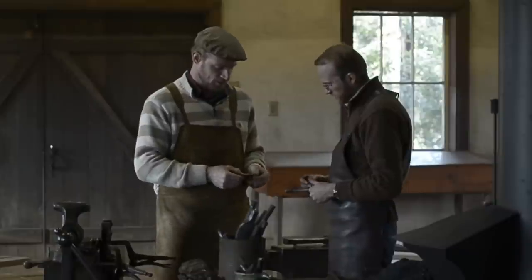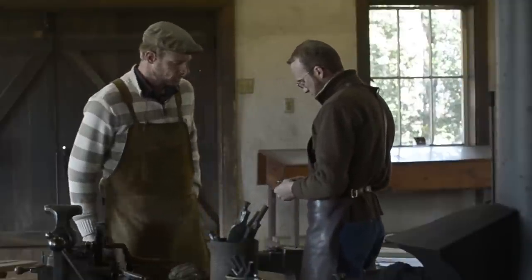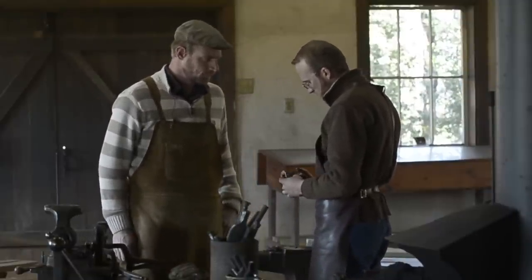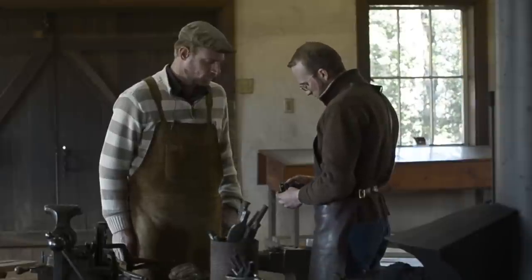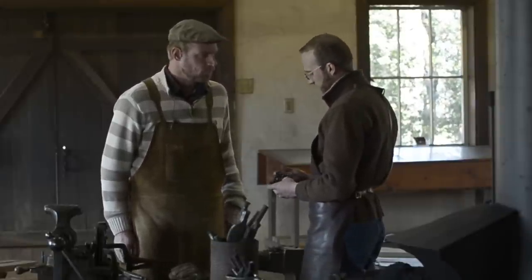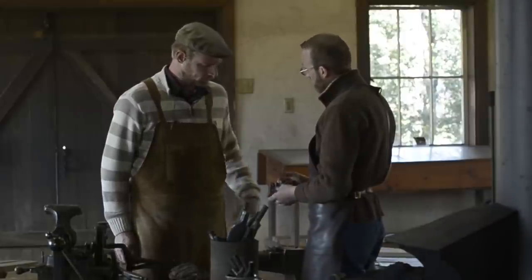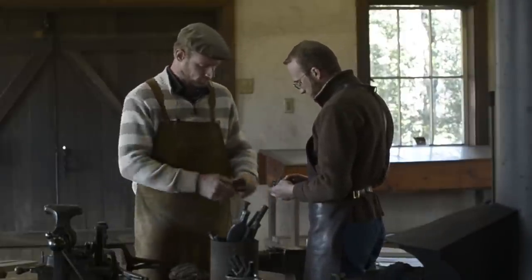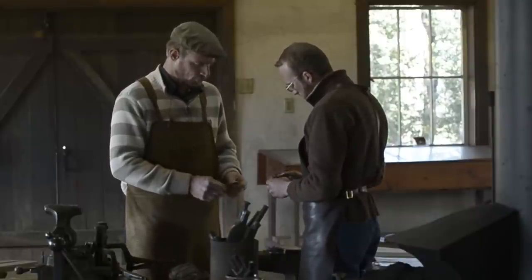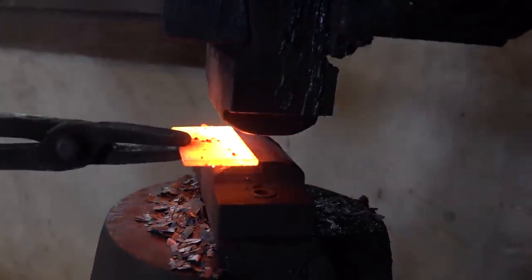So, how did you do these hinges? These are great. Start with a flat piece. Our relief needs to be three-quarters, so start at about an inch and a half. The part that needed to be the barrel, we need to draw down a little bit, thin it down, because bending a full eighth around that tight would be very difficult. So drawing out — you're talking about just making the metal thinner. Right. Hammering out.